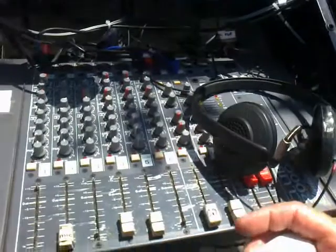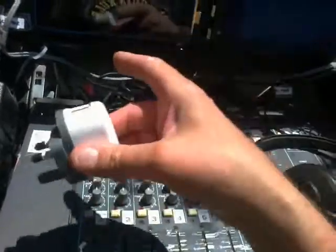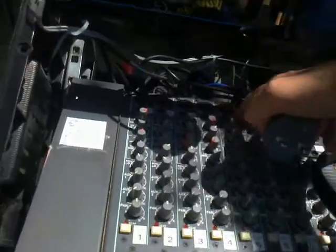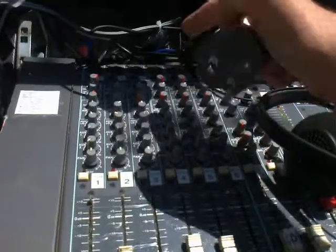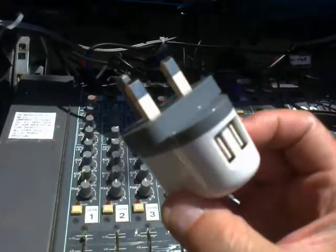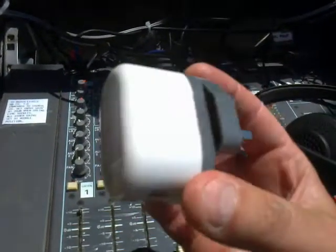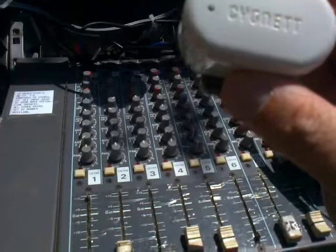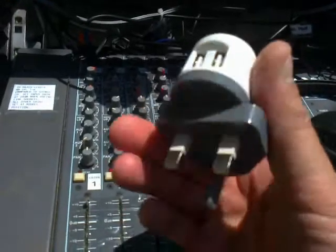So the moral of the story is, if you're using tablets, or you take your tablet and have an extra audio source plugged into the mixer — into one of these line sockets or whatever you've got — if you get a buzz and you've got the power supply in, change the 5-volt power supply, because it's this horrible thing. I don't know where it came from; I think it was a sell-off job, one of these bargain bucket things. It's called SIGNET. It makes a horrible interference noise with the mixer, and my leads are all fine.